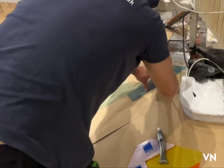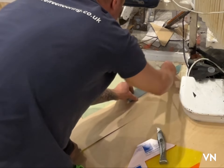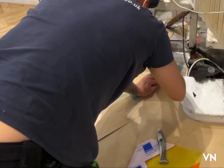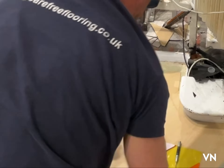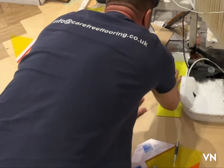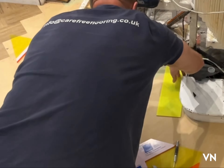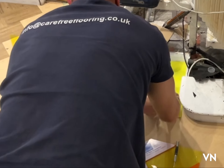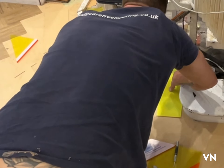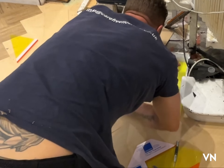It's easier then — you've got to flip it over the other way around to do the other mark. But if you slip off, come off square and you don't know you're going there, you're not going to get it. Now you just put your template on there and see where it hits both your marks. If you push too much towards the wall you'll tilt that out — that's what you did last time. You can't have that — you want it just butted off that beneath. Slide it up to score the line gently, then redo it once you've got it on that mark.